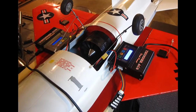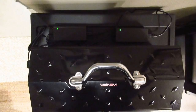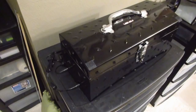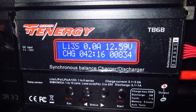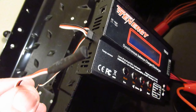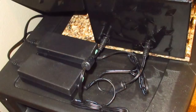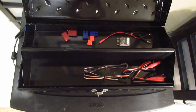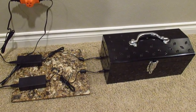I've been using AC6 chargers reliably for years but this time something different failed. Since I always thought there could be a better way to charge LiPo's, I was forced to make a better charging bag - completely self-contained - which I call my LiPo charging station. I decided to purchase two Tenergy chargers that can charge a maximum of five amps. I picked them because they use the same software program as the AC6 which I'm familiar with, and they have separate power supplies outside the charger so no fan is required inside. I also picked up a metal toolbox from Walmart for only $19 to build my own self-contained charging station.